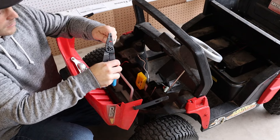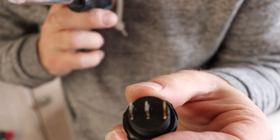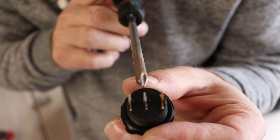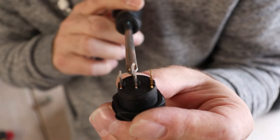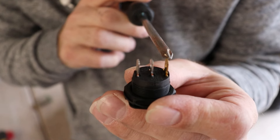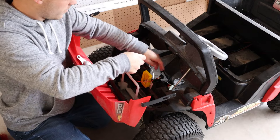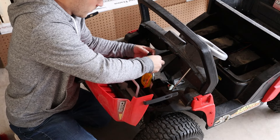Next I'll add a length of wire to go between my fuse and power switch so I can mount the switch on the dashboard. For the main power switch I'm going to use this simple rocker style switch. The incoming power from the fuse is connected to the middle terminal, the brass color terminal on the right is my ground, and the terminal on the left is my output power when the switch is on. Be sure to check your switch if the terminals differ.